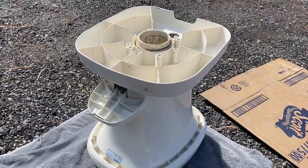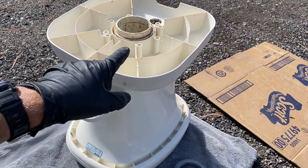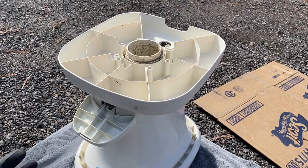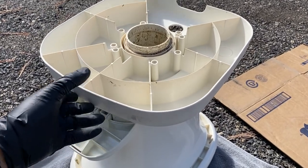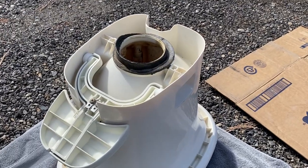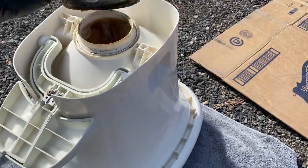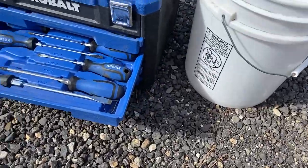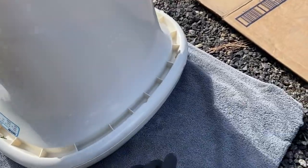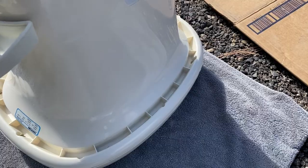When I took out the toilet, the closet flange came out with the toilet, but they're actually supposed to disconnect, I guess, when you take them out in the bathroom. Mine just happened to stick. That's no problem. Upside down, you can simply wiggle that off. And that's going to expose the toilet flange seal. You'll want to peel that out and throw it away. And you'll have a new one that you can put on later. For now, you can just cover it with this cap.